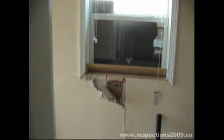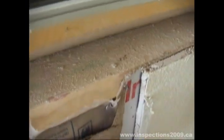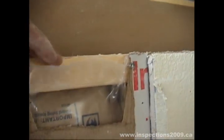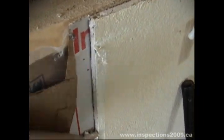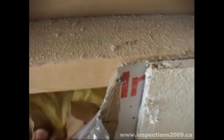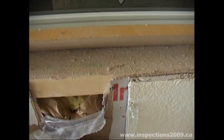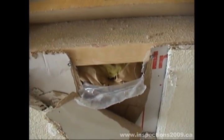That is consistent with ninety percent of the homes we have inspected. This is an outside wall window — showing the poly is cut and is not attached to the windows, also showing the vinyl board. Poly unmarked, Kraftback paper insulation — three vapor barriers with no continuous seal. Again, consistent in ninety percent of the homes or even higher. This concludes today's taping of August 5th, 2009.